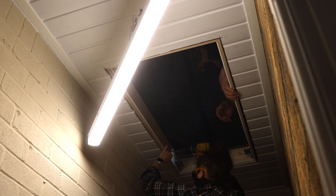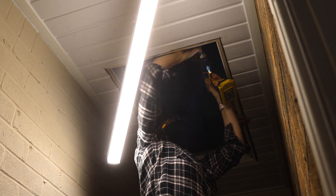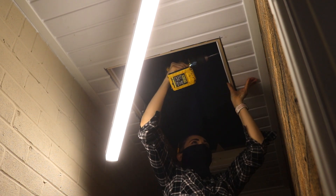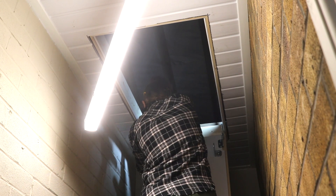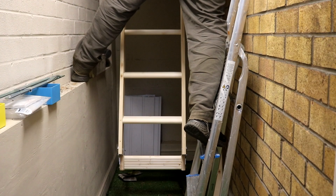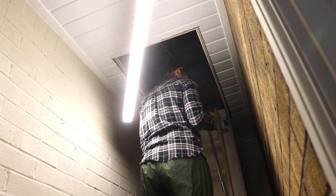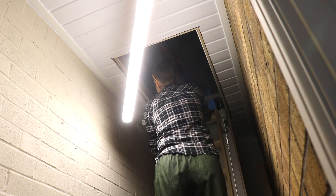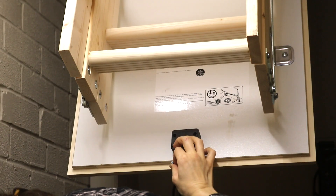Then I could work on getting the other sides flush as well. It's tricky work when you've got to keep moving the ladders. Because the loft insert is much slimmer than the framework I built, I didn't want to go too fierce with it, so I didn't use an impact driver. Then I screwed the loft hatch cover to the frame with the screws provided on the hinges. For the ladders, these came much longer than needed and they fold up. I then screwed some metal strips on the frame either side — note there was a washer there as well, which allows the ladders to spin around. The latch slots into the manufacturer's holes; I put the screws in to fix it without dropping it on the floor.